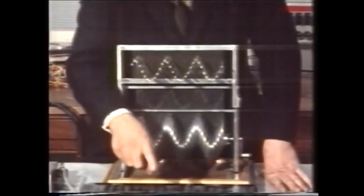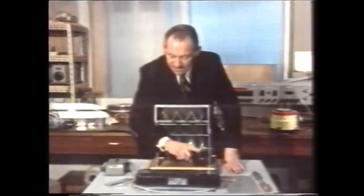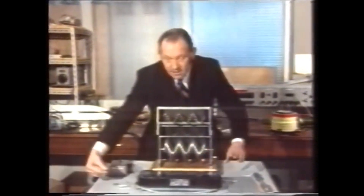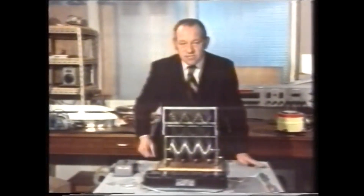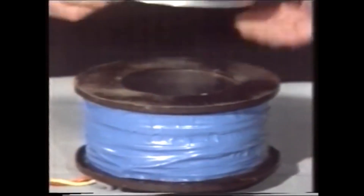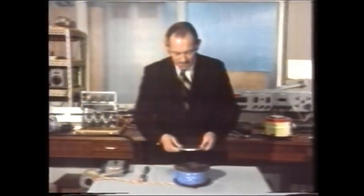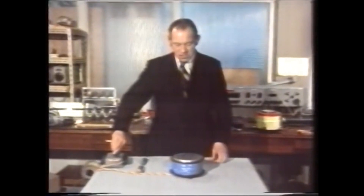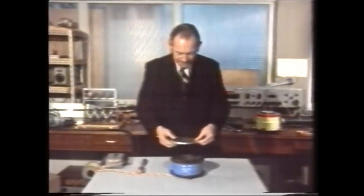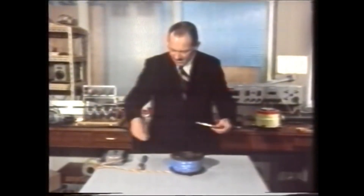It's exactly the same with this magnetic river. I can switch it on and there is nothing above there moving horizontally until I put in the aluminium — and like putting the ball into the rods, so this is our first step towards a magnetic river. This is a single coil and a plain sheet of aluminium, so it will behave rather like our jumping ring. Switch on — it goes. Try and put it back — it floats, it has a really good try at floating, but it doesn't make it.